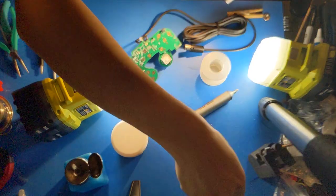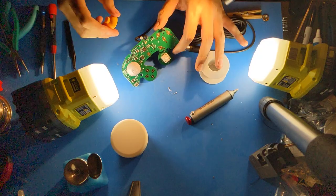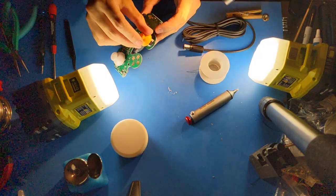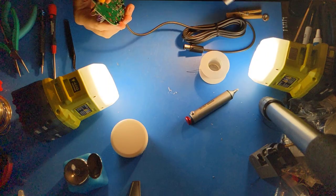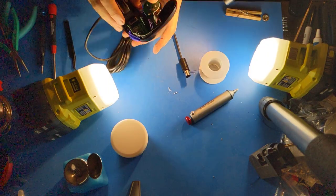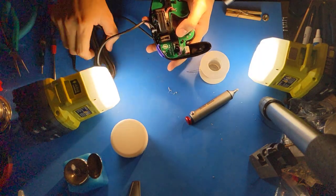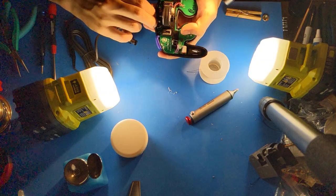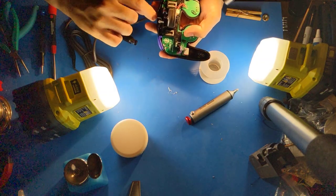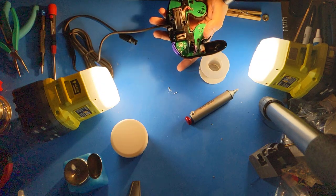Now, I will take the stick caps, reinstall them. Don't forget this step. It's very annoying when you put your fob back together and you forgot the stick caps. Insert it in the top shell. Make sure these sliders are all the way towards the cable side of the controller. Make sure the cable lies flat, is tucked around the loop, and is sitting neatly in the cable hole.